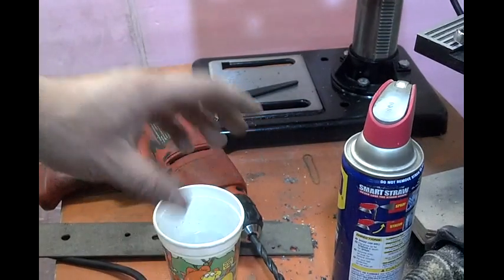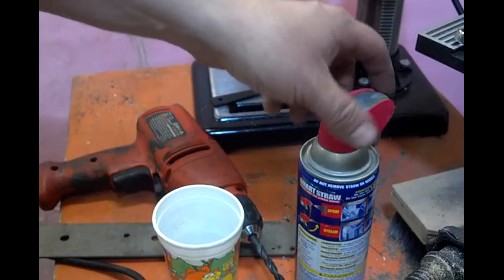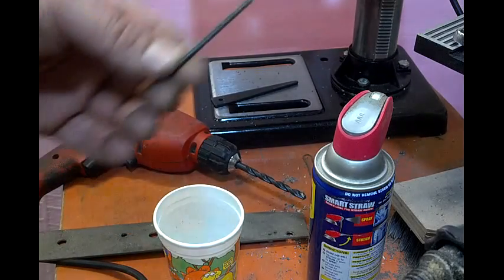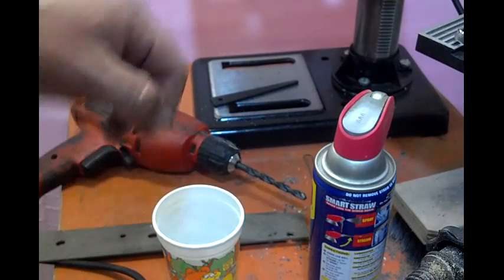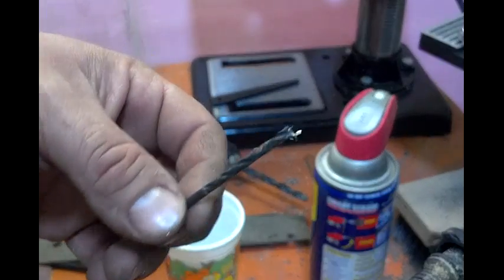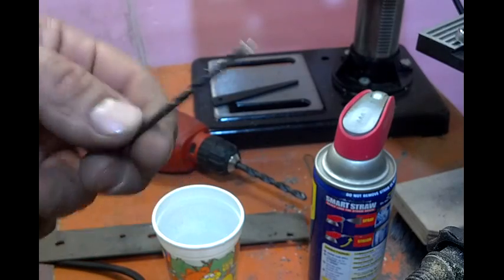Water is a coolant, not really a lubricant. This is reducing friction. I don't want to spray oil on my table or my piece and get it everywhere. That goes to show you my little trick for drilling stainless steel and hardened metals: go slow, go very very slow, use a small drill bit first. These bits are about one-third to one-fourth the cost of a larger drill bit — about a buck twenty a piece. Just buy basic split point black oxide, made in the U.S. You don't need fancy German or aerospace technology. Just get good old-fashioned U.S.-made black oxide split points. Go slow, start small, then step up to your larger drill bit.